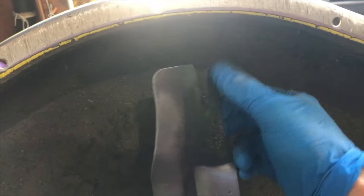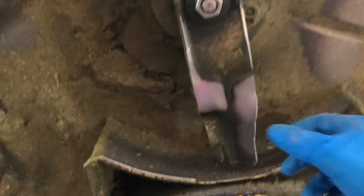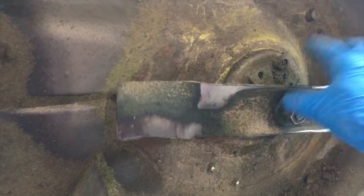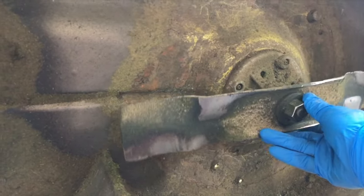I've got some cracks on the blades here — I think two of them are going to need to be replaced. This one is okay and could be sharpened. I've been running this mower for about three and a half to four years, so it might be time to replace all of them.